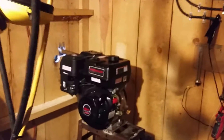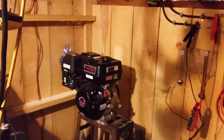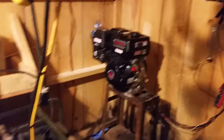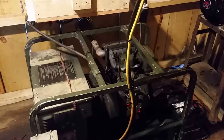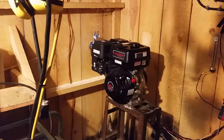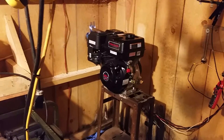What this allows me to do is bulk the batteries running a cheap engine at 2000 RPMs, directly to the batteries without going through the inverter. The other generator is $3,000, running at 3,600 RPM and noisy. This inexpensive motor running at 2000 RPMs makes much more sense. With the switch down I'm able to use the voltage regulator and it'll bulk the batteries.